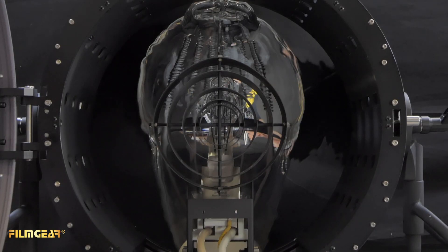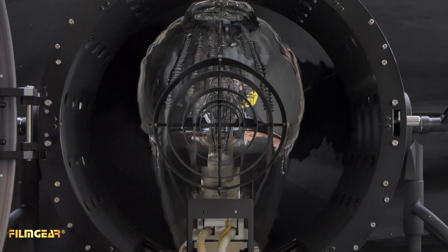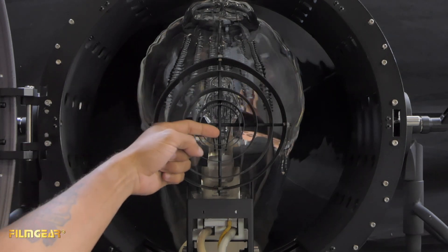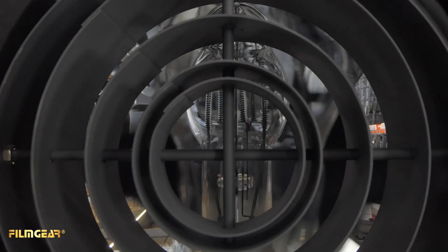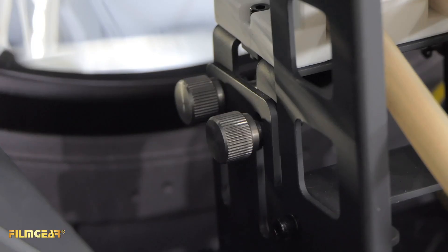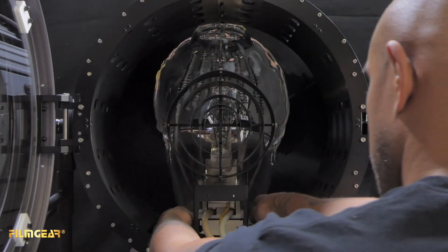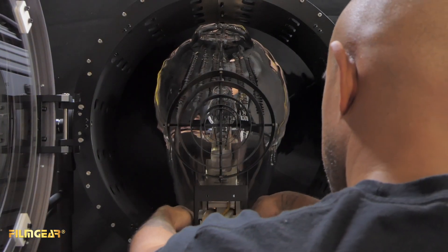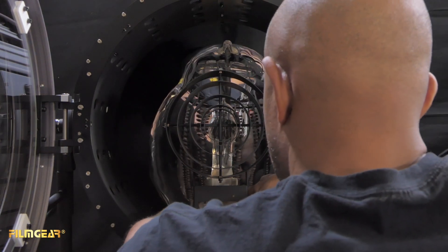With the dual globe heads, you can swap out which globes you put in each light depending on your power needs. Right now we have a 5K globe in the 5K/2K, but you might notice that the center of the bulb is actually higher than the beam guides — it's currently here instead of here. To compensate for that, you can adjust the height of the beam. Simply go in here and spin these to loosen them, then tighten them once the globe is in the correct position.